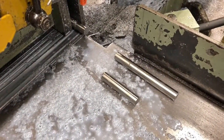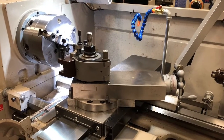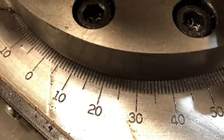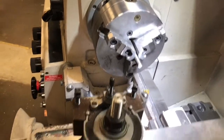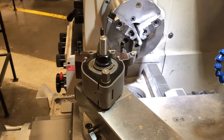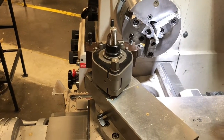Quick little cut. This is what a 30 degree setup looks like to cut an included 60 degree angle. I set my offset to 30 degrees. The tool looks like this and here's my work piece, and I'm going to feed in using this handle and it'll feed in on an angle like this. So 30 degrees will get me a 60 degree included angle.